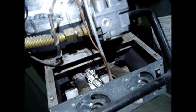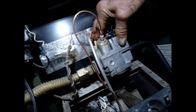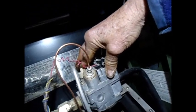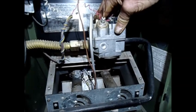The pilot light does light — that's a good thing. That means basically this valve is probably okay, at least part of it is. Pilot light is lit, and you've got to hold this down for about a minute. If we let go and it stays lit, then that means the thermocouple is good. Thermocouple is good. So what we're going to do is check the wall thermostat.